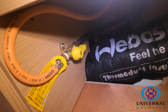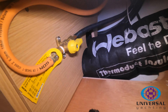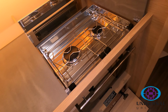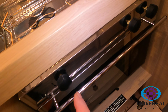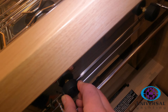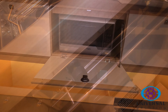With the switch going across the pipe or vertical, that's off. We always recommend that you turn this off when you're not using the cooker, just for safety reasons. The cooker is controlled using the knobs on the front — you just hold those knobs in and light the cooker with a match. If you hold it in for 10 seconds, that will activate the flame failure device and the flame will stay alight.